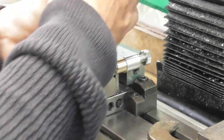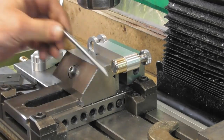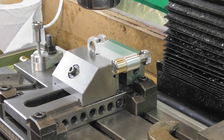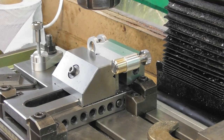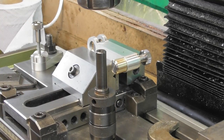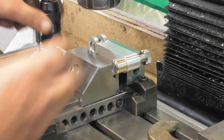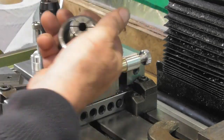Okay, it's going to be a quarter reamed hole to take the quarter silver steel. I have a quarter reamer. I think my 6mm chuck will be the boy. That'll be the chuck of choice, 0 to 6mm. That's going to need my 12mm collet. There we go. So let's just swap over.